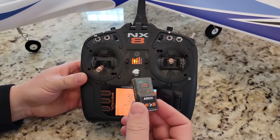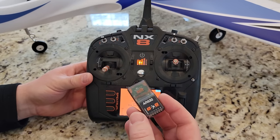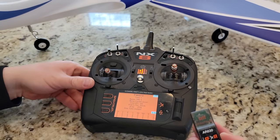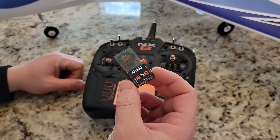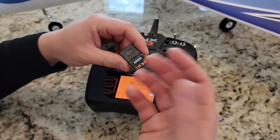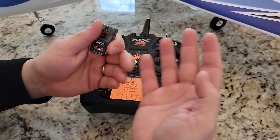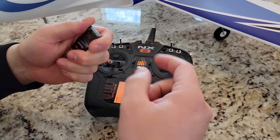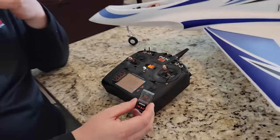We don't have that. We have the AR-630. So we have voltage on the BEC, because we know what it is on this thing. We don't know what the voltage is on the ESC, because that's not part of this electronic circuit per se. The BEC takes power from the battery through the ESC, that's part of the ESC circuit, or a separate BEC, or an SBEC, a switching BEC, or a UBEC, which I forget what the UBEC stands for right now.